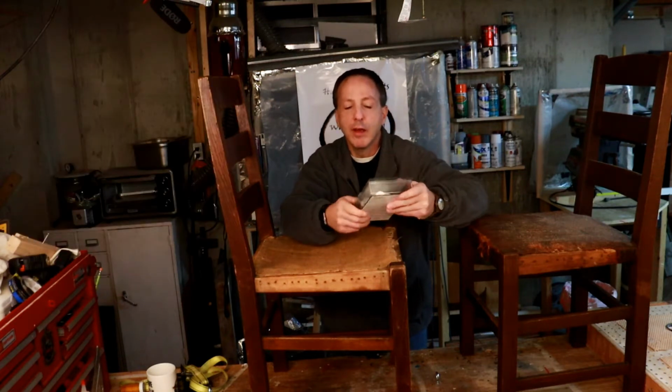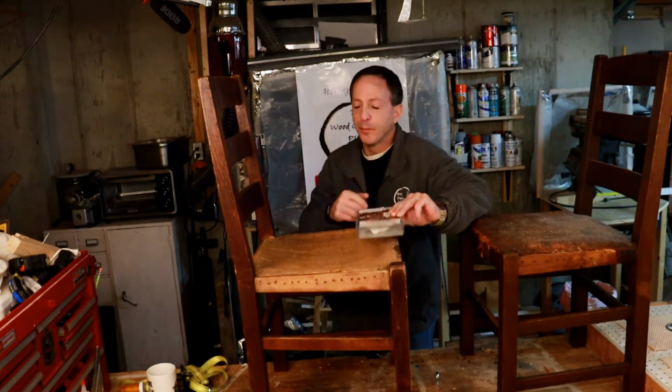This is a nice, really low viscosity glue that does more than just glue the wood together. It also gets into the fibers of the wood tenons, so that it soaks in and helps them expand so they get tight in the joint.